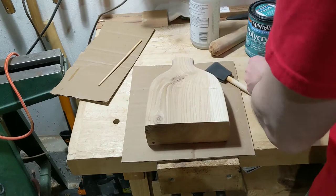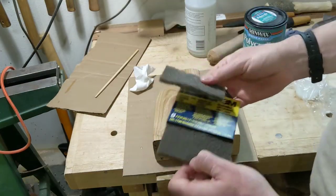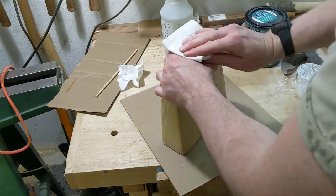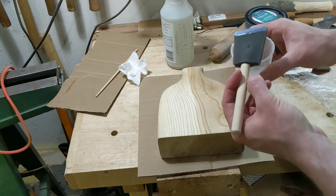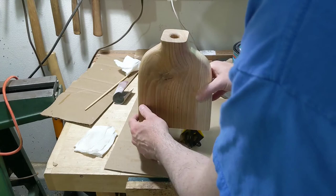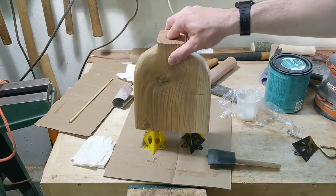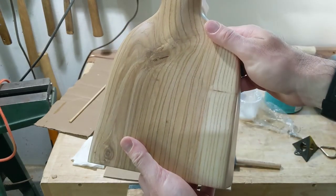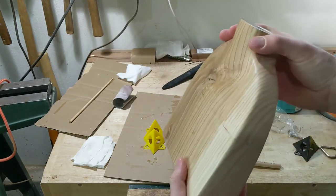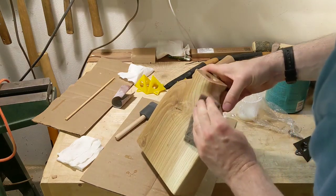I did the first couple of coats with it laying flat, because I find there's a little bit less streaking. Then I go over each coat with these 3M painters pads — the gray ones — which just rough up the surface a little bit. Then you clean that up with a little bit of water and a rag and put another coat on. I think I did three coats total. Even with that, I still got a little bit of streaking, which you can see when the light catches it. But that's okay — hitting it with that pad just takes the sheen off a little bit and gets rid of some of the streaking. It's kind of an amateur's way of getting a better finish.